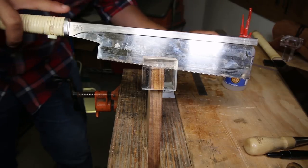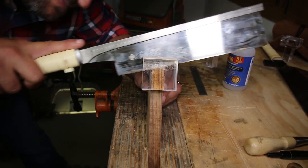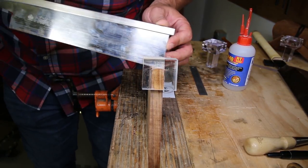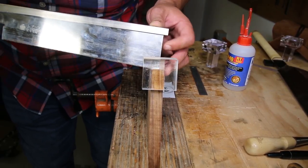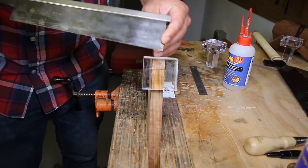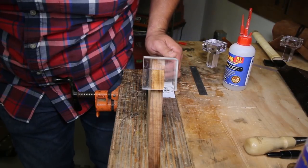So what will happen — I'm going to exaggerate this a little bit — is you look over and you'll get to one side of your line and then get to the other side here, and you get that little area in the middle. So what you can do is take the end of your saw here, tilt your saw forward like this, and just drag it through. You can see the edge of your saw works as a depth guide if you tilt it forward using the last tooth, and it gets you right down to a perfect straight line.